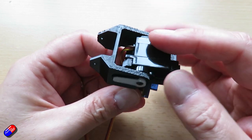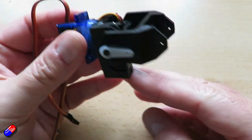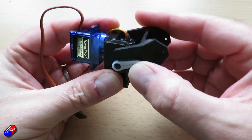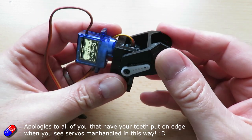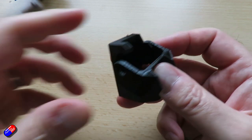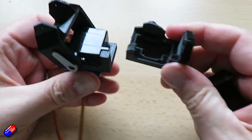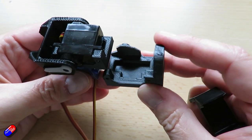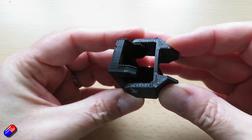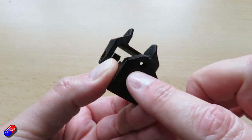The other thing I realized when I was designing this is that you could actually have it the other way round — with the pan servo at the bottom and this as the tilt bit — and that would give you much more up and down movement as well as round and round. That is actually what this version here is. This version is also available on Thingiverse — link below. It's the same kind of cage but this bottom bit means it's actually mounted vertically, with a shorter stubby camera mount. The servo goes in there giving you that movement, and it rotates around this bottom part.